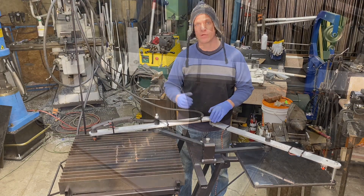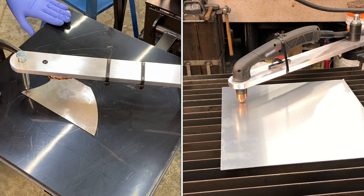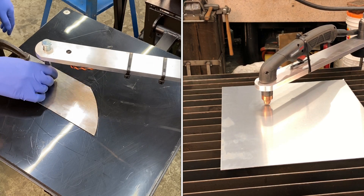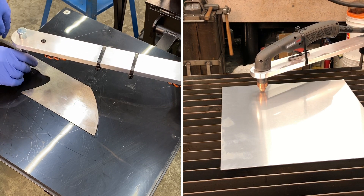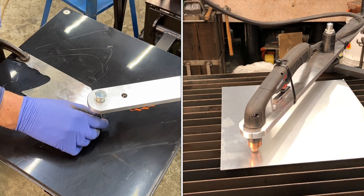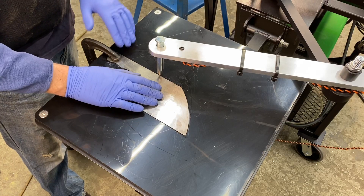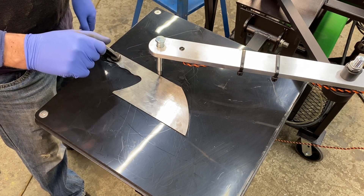So let's try this thing and see if it actually works. The first thing I want to do is place my template down on the copy table and I have my stylus. After I put my plate on the actual plasma table, I'm going to take a look at the movement to make sure that first of all I'm going to start off of the plasma table or off of the actual part, and then as I go around I'm not wasting too much material. I could move this over a little bit more to the edge but I'll leave it here. I'll go all the way around and make sure it's going to cut the complete template, go around, and then off. After I'm done this one I'm actually going to trace it — you can see it on the plastic, it actually traces it on there — and then I'll move it over and cut another one right next to it.